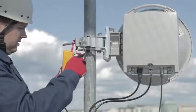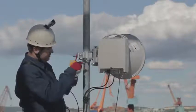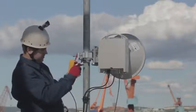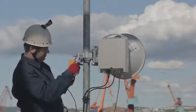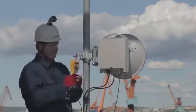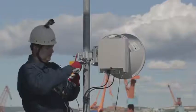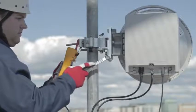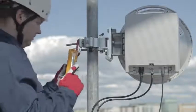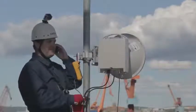Fine alignment is about finding the absolute peak — you should only have to do very small changes to the antenna direction. Search for the maximum reading in azimuth by carefully adjusting the antenna direction with the two azimuth adjuster nuts, then lock the antenna in place. Do the same for elevation — carefully adjust the antenna direction with the elevation adjuster. When you are happy with the result, hand over to your colleague at the far end.